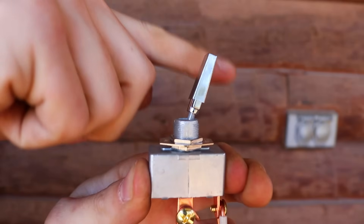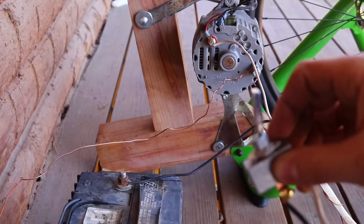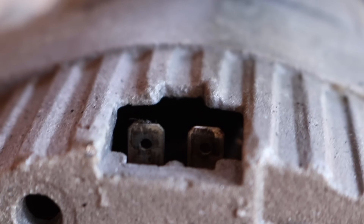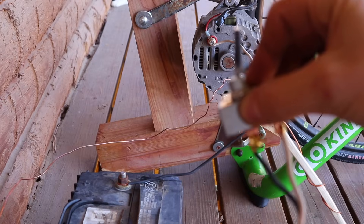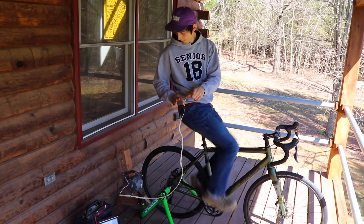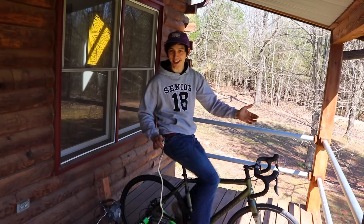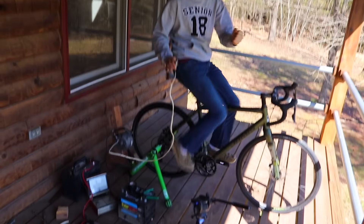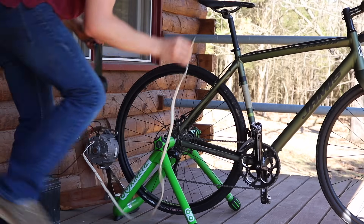Referencing Leo's video again, I made a few changes. That included introducing a switch on the wire going from the alternator's power output to the positive on the battery. Also, upon further examination, I found two prongs that required being looped into the power output as well. With the new switch and the wire attachment, I re-tested the generator — and it worked! No kicking on and off. It started charging the battery.